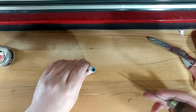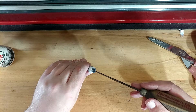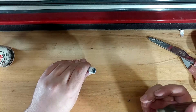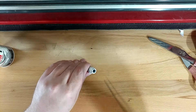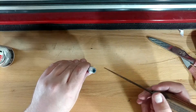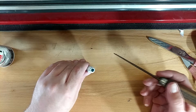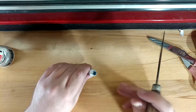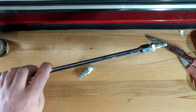Another disadvantage, although I've never personally had a problem with it, is that you can pretty easily get excess Teflon tape over the end and risk blowing that free tape out into whatever thing you're trying to operate. You wouldn't want a piece of tape blowing into your die grinder, tire gauge, or a piece of industrial equipment. So a lot of people don't like this stuff for those two reasons. I've kind of gone away from it just because it's harder and takes longer to install than the goop, but we'll go ahead and use it and install it properly.